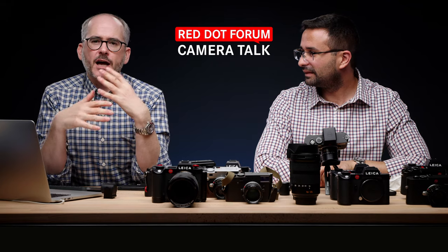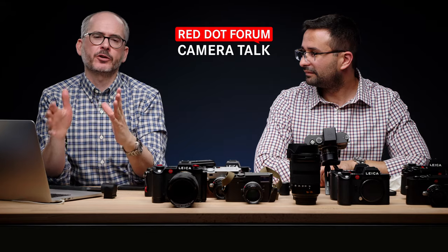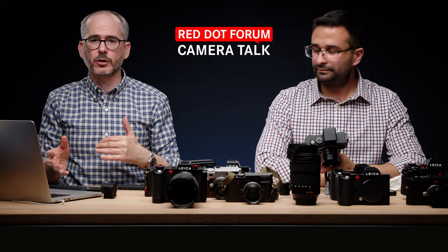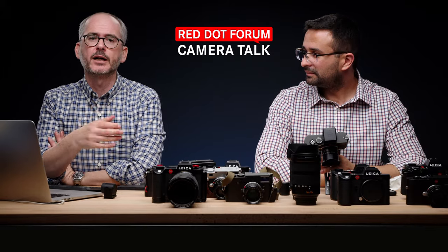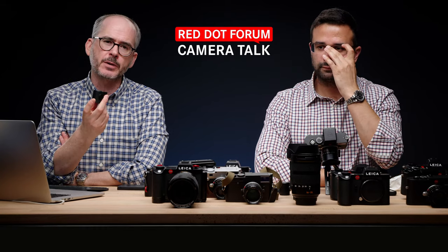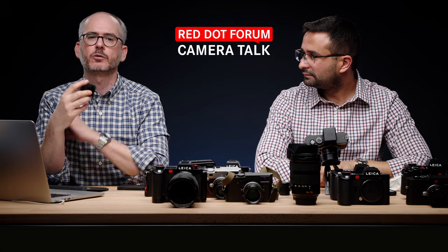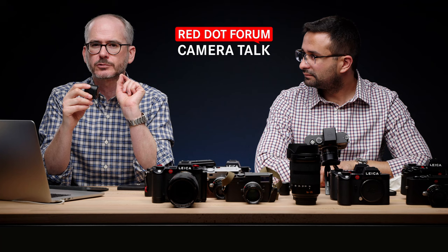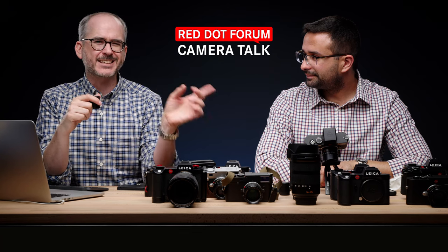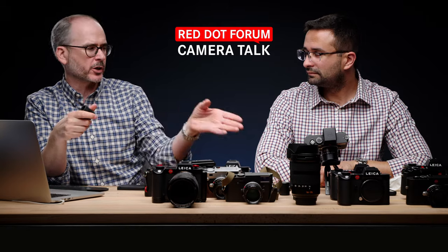What we saw is it's not readily apparent that it's that much smaller because it's using an OLED panel. If you're familiar with OLED, either you have a television or computer monitor or an iPhone that's OLED tech, what's really cool is that black is pure black because there's no illumination. There are self-illuminated pixels versus an LCD panel, which has a backlight. So even the black pixels have a backlight, which makes them a little bit gray. Blacks are never pure black. So it's not totally noticeable that it's missing anything when you put it on an M10.